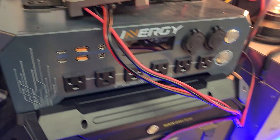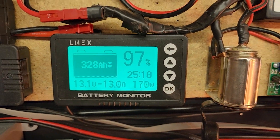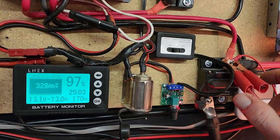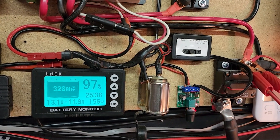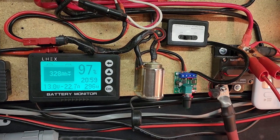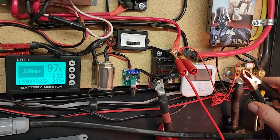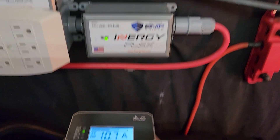You can also use this to add a solar array to an already existing one. I already have solar coming in at about 300 watts, but we're still about 13 amps shy of being in the positive — I'm using more energy than I'm bringing in. I was able to directly connect this charge controller to get that extra 10 amps into my system. When I disconnect the LNEX, that goes up to about negative 22 amps because we lose that extra 10 amps. When I hook it back up it goes from negative 22 down to negative 12, so you can easily add more solar arrays to your system with this unit.